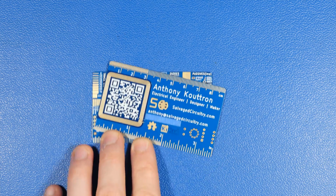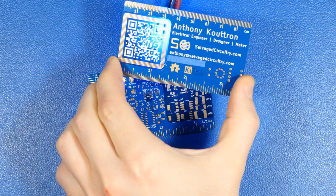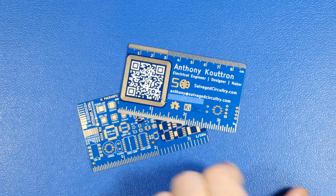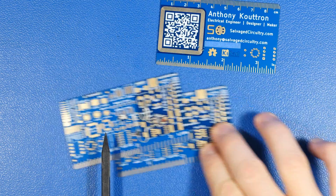One of the challenges faced with this design was underestimating the amount of light fall-off from 2 layers of solder mask. I originally implemented a 400 millicandela reverse mount LED to illuminate my logo on the top side. This was a far cry from the light output actually needed. I soldered in a high-powered LED and a tiny ML421 lithium-ion battery as a quick fix.